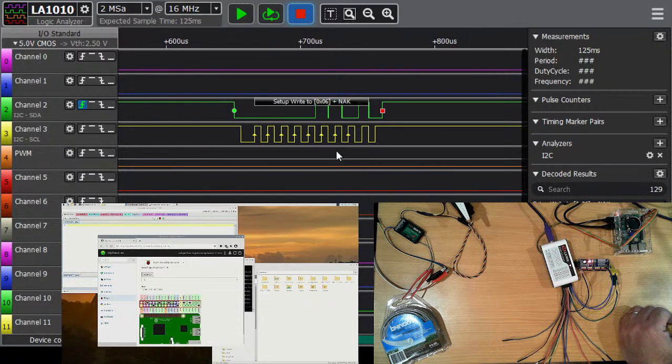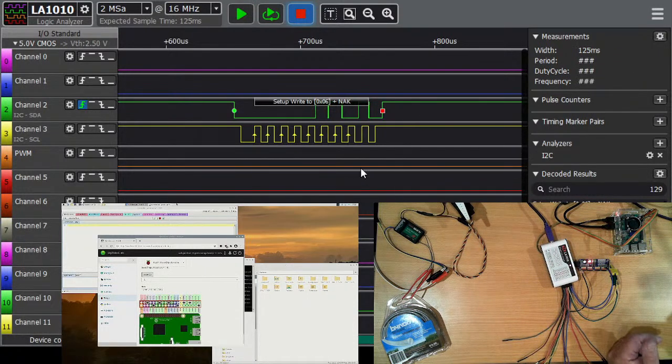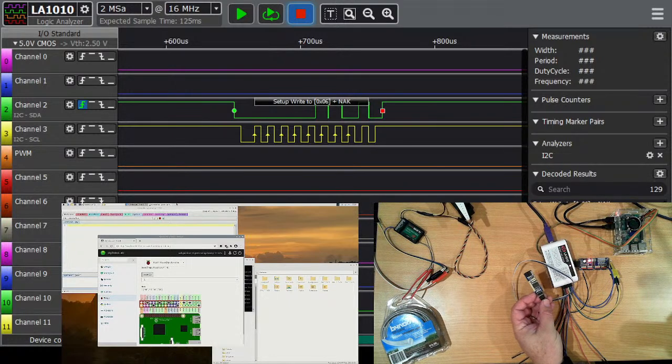One of the really cool things with a logic analyzer like this is you can capture the data being sent, and it'll actually decode the bytes for you. In this case, I happen to know this is connected on 40. 20 is not connected. I might have to restart that to clear those off. That's from a previous scan I've done, when I was having a play last night and I had one of these devices connected. These are an 8-bit I/O expander. These are addressable as well.